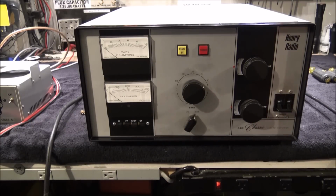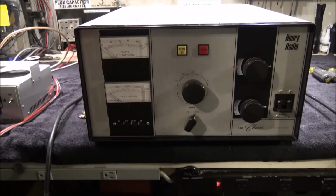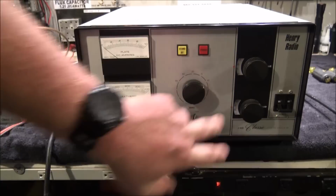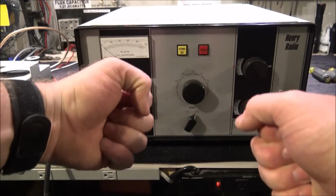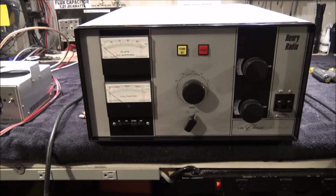And up until about 20 minutes ago, it had the stock lights in it, which were both burned out. I'll send these along with the amplifier if you want them. Now, all of you that have ever had the wonderful pleasure of changing out the lamps behind this face that light up your two counter knobs know exactly what fun I just went through with these giant gorilla hands. I've got to very carefully change the two lights that sit right behind this face. It's a little tight.